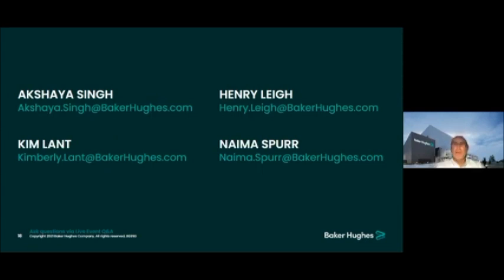The first question, in terms of how much volume we need to pump, as Akshay had mentioned, we strive to go radially about 10 feet into the formation. For this, we need to calculate the volume of rock, or the volume of porous space, that is going to be in 10 feet. So we need the height, the porosity, and the radial penetration, which is usually 10 feet.